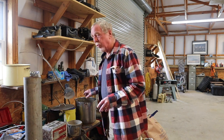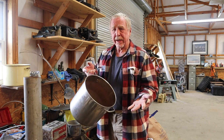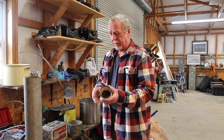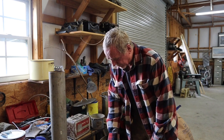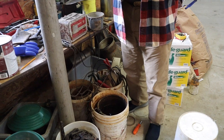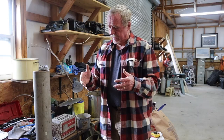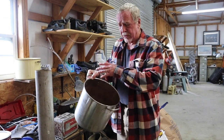People say don't use stainless - well, that's a mistake. Use stainless. Go buy one of these things made out of stainless. They're cheap and this is all you need. Then you cut your pieces of PVC to hold the object you're going to be cleaning off the bottom so it doesn't short out. This rig here - a plastic bucket with water in it, and inside is a piece of stainless that goes around. People do it wrong by putting a piece of rebar in there - it'll only clean one side. Electrolysis is directional, so it needs to go all the way around whatever you're trying to clean. That's why this pot is good because it goes all the way around and underneath.